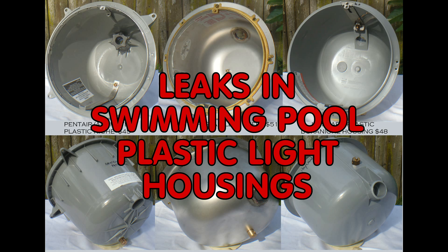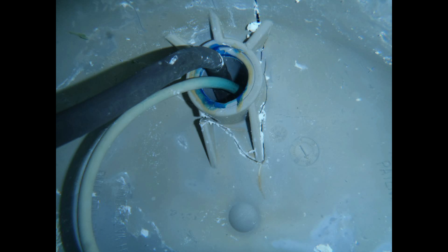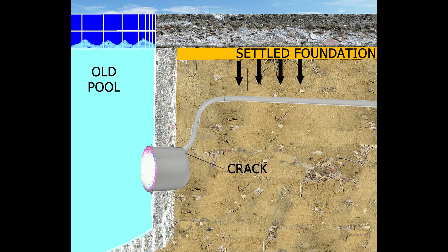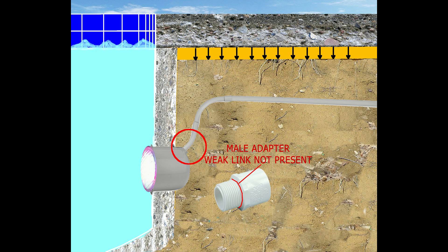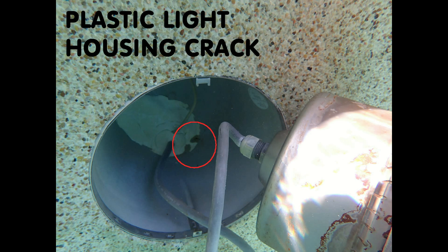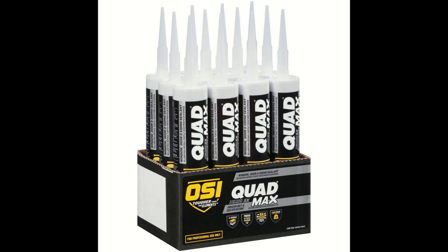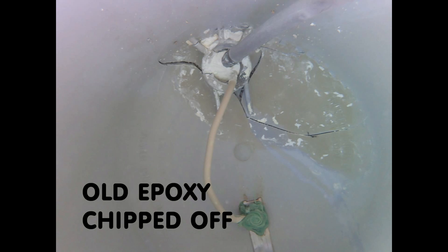I've made another YouTube video dedicated to cracks in plastic light housings — an eye-opening video about a big problem in the pool industry caused by these faulty light housings and the way they fail. There are about five different manufacturers but they all have the common problem of cracking in the back of the housing. The crack is caused by the weight of the dirt settling on top of the conduit and bending it where it's connected to the back of the housing. In plastic light housings the conduit is glued directly into the back, so the entire housing starts to split under the load. I've had some success gluing thick vinyl patch over the cracks using Quad Max as an underwater adhesive, but you really have to sand the plastic thoroughly or the adhesive will not stick.